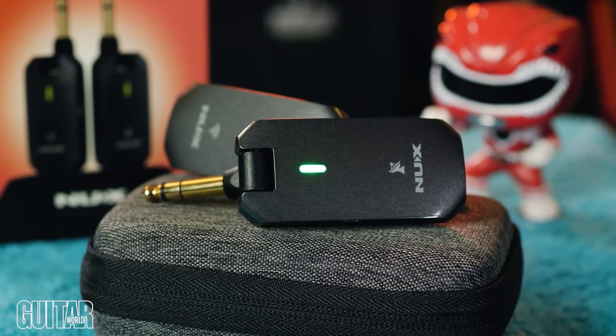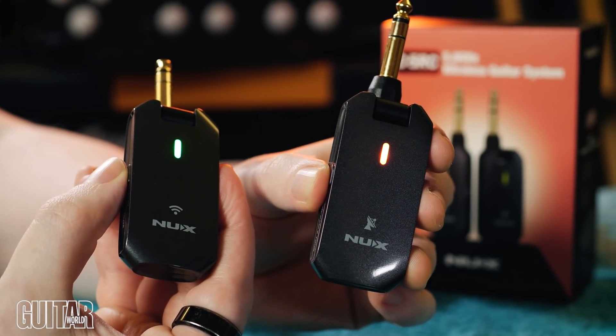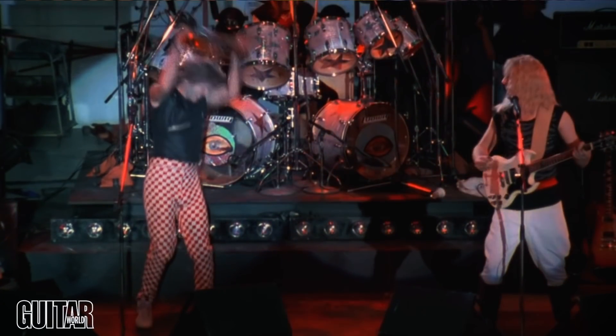The carrier frequency is exactly what it sounds like. The digital data package of your signal is carried on an ultra-high frequency transmission wave between the transmitter and the receiver. The carrier frequency will have some impact over the range, spread, and how much data can be transmitted per second, but what we really care about when sending our guitar signal wirelessly through the air is whether that transmission will interfere with other transmissions of the same frequency. As wireless technology forever expands, there's an ongoing arms race to transmit in unoccupied frequencies. It wasn't so long ago that 2.4GHz was the ideal range, as it was so far above other radio broadcasting frequencies that you'd never encounter that Spinal Tap military-radio-through-the-amplifier situation when using a wireless kit.